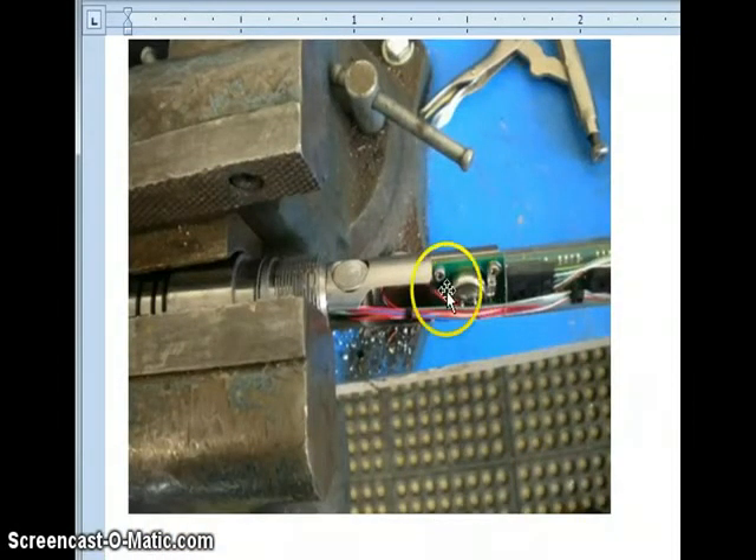Here are the two geophones if you have a seismic cone — these are the two S-wave geophones. If you had a P and S-wave seismic cone set up, one of them would be pointed vertically instead of side to side.